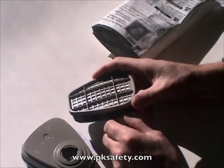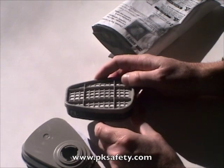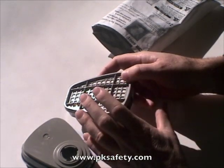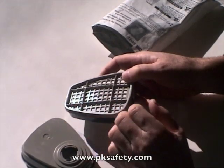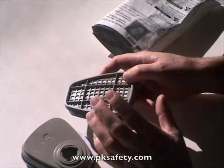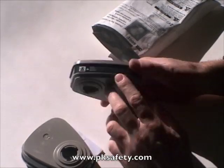The second thing is that over a period of time it can absorb only so much — there's only so much absorptive surface on the charcoal inside, and it doesn't dry out. You can't recharge them or air them out; that doesn't work. There are chemical bonds that take place as vapors pass through, and the surface gets used up.